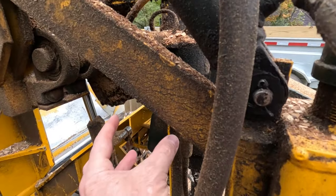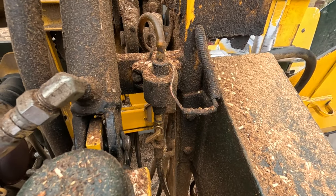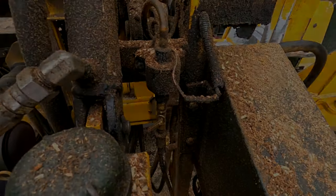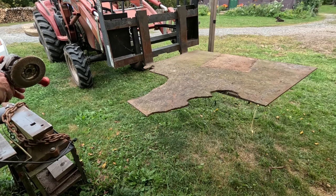So it's got to sit down here a little bit farther because of its size. So I'm going to get my tape measure and start doing some measurements. I'm going to do that off camera and see where we wind up. I found a piece of 5/16 thick steel plate, which will be perfect for my needs. That will support the heavier oil pump.